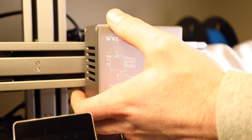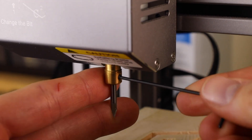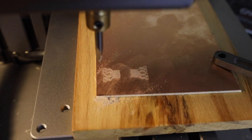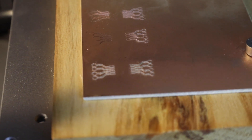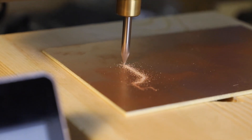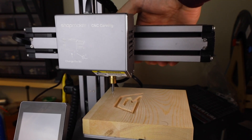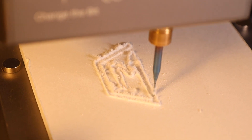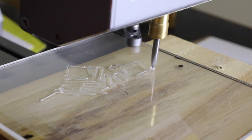However, even with the new toolhead, the grub screw is not a great solution for keeping the bit attached to the spindle. It takes a 2.5mm Allen wrench to tighten it down, but after a few uses I'm already seeing that it's starting to strip. I also noticed that the right side of the build plate seemed to be higher than the left side, so when trying to cut precise things like PCB routes, the left side of the design would hardly scratch the surface and the right side would cut so deep it ruined the copper traces. Luckily, I was able to track this down to the x-axis being mounted just slightly off level, and I was able to get it quickly adjusted. So far after a few cuts, I have been very happy with how this thing performs. It's super easy to access the build plate and secure and remove the workpiece, and the bits can be swapped out quickly so you can maximize your time cutting.